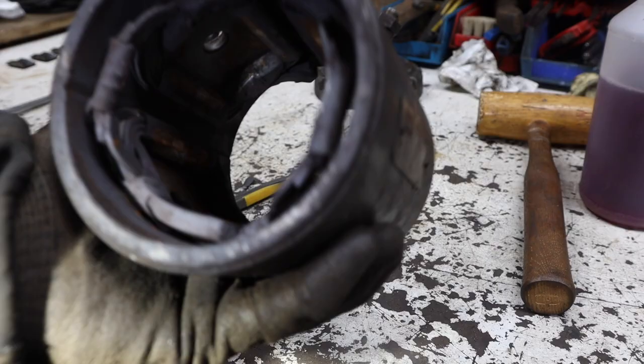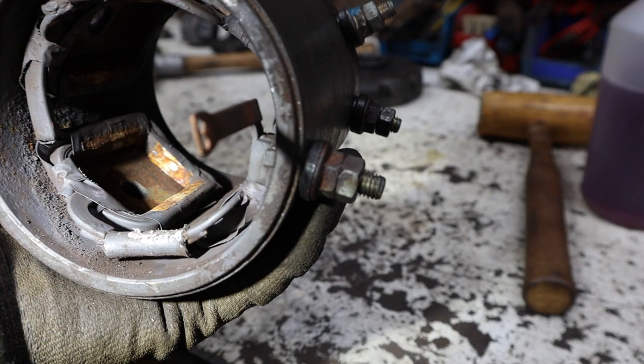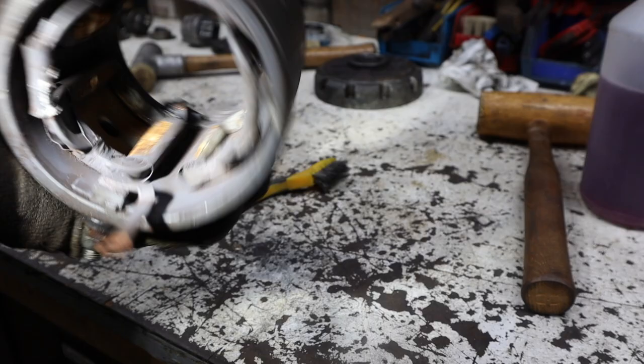Inside the actual motor case here, you can see there's surface rust kind of around each one of those windings. So I'm just going to go in there real gently with a small wire brush and clean that up. Maybe that was making it so it wasn't quite getting connection and the power wasn't running through